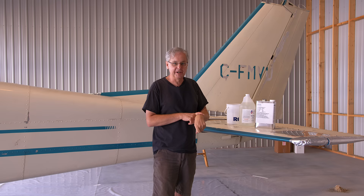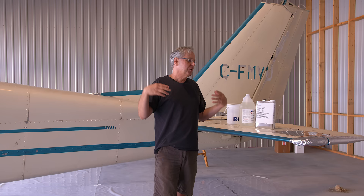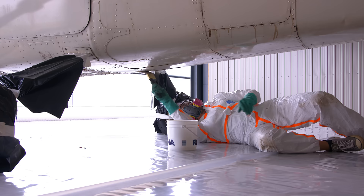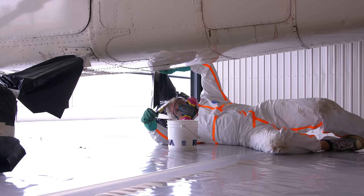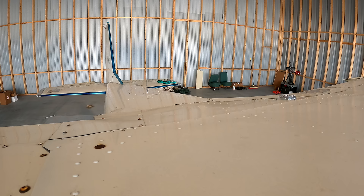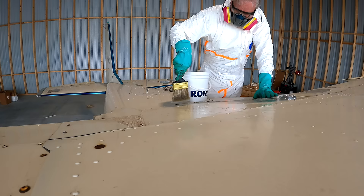This stuff will burn your skin if you get it on you — I used it inside the cabin to take off tar, pitch, and glue and it burns. So I'm going to be wearing a Tyvek suit and a respirator, because the MSDS data sheets list a number of chemicals that are bad for your lungs if you're around it all day. I'll be applying it with a brush out of a bucket since I don't have a sprayer. Time to suit up and start painting this on.